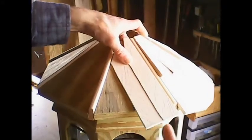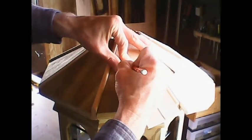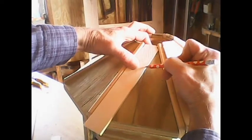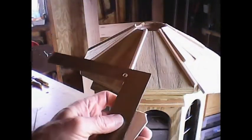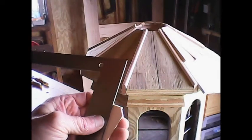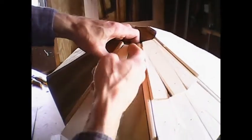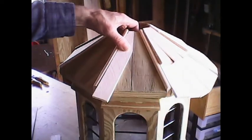I have one side done and I'll do the same thing on the other side now. I've got it roughed in up here. Again I go for my center line here and bring that in. These are all just rough lines right now because all this is going to be cut out also — I'm just getting this to fit in right now. I double-check to make sure I've got my distance, check my line, and it's looking good. Now I'm ready to nail this on and nail the other side on.